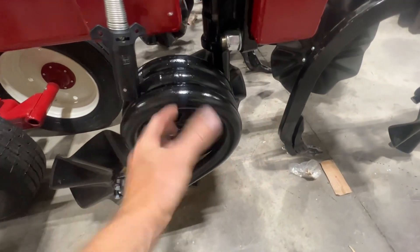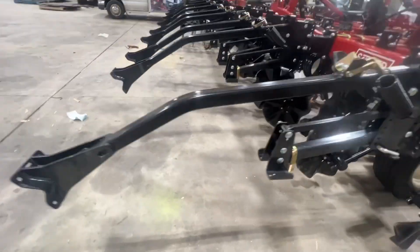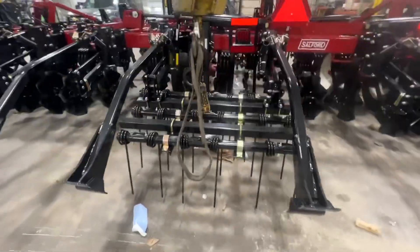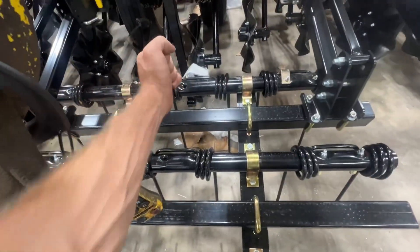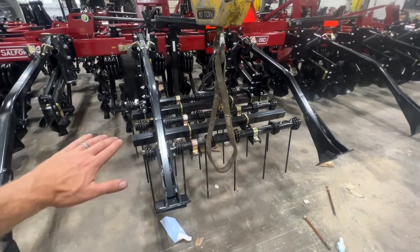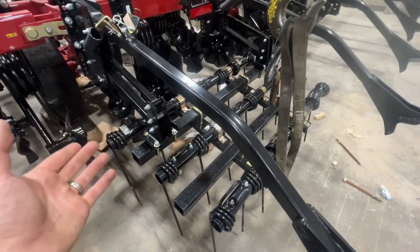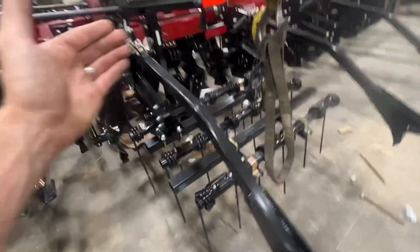We haven't got this tool quite wrapped up yet. The guys used the crane to lift the coils up into the housings today, and they're working on getting the rear harrows and baskets on right now. These harrows are completely in charge of the leveling of the tool. There's a handle that adjusts how rigid they run — the more rigid they run, the tighter they'll be on the ground, the more aggressive they'll be, and the better they will level. You can't always run them rigid; in high residue like fall corn stalks, you'll just drag, so you run them as tight as you can without creating beaver huts through the field.